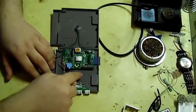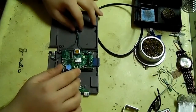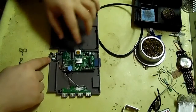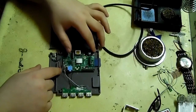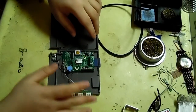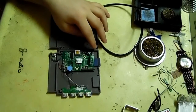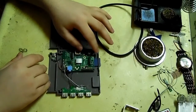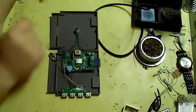This is the extra space I needed for an additional circuit I'm going to be doing later on with the GPIO pins. Right over here is the switch that's mounted, and here's the mini USB breakout board. I am just interrupting the ground signal. The red wire goes to the poly fuse on the other side of the Raspberry Pi so I don't have to mess around with the micro USB pinout. I ground it in a dirty way, but it works — more than half the time the metal housing around micro USB connectors is grounded, so I just soldered the ground wire right to it. A dirty way of doing it, but it does work and there's a lot of surface area so the wires don't pull and break.